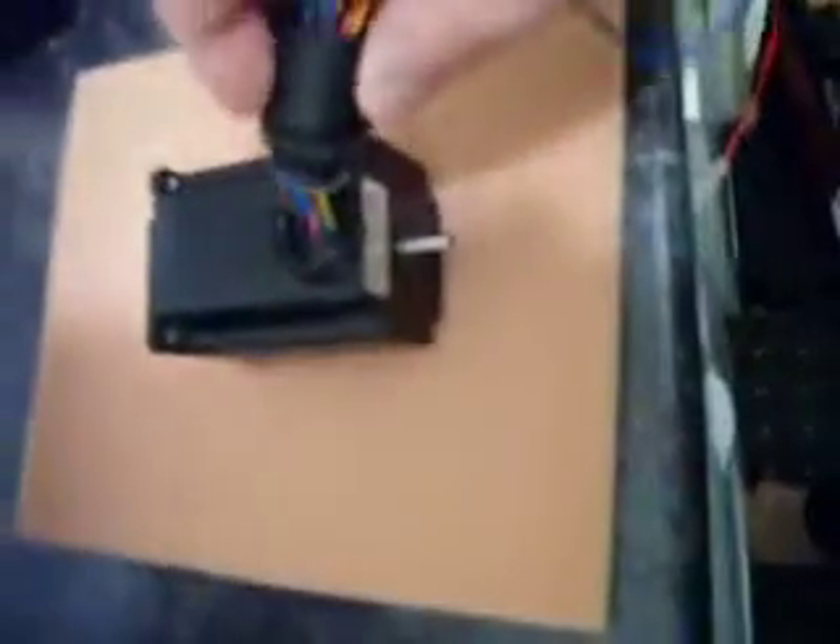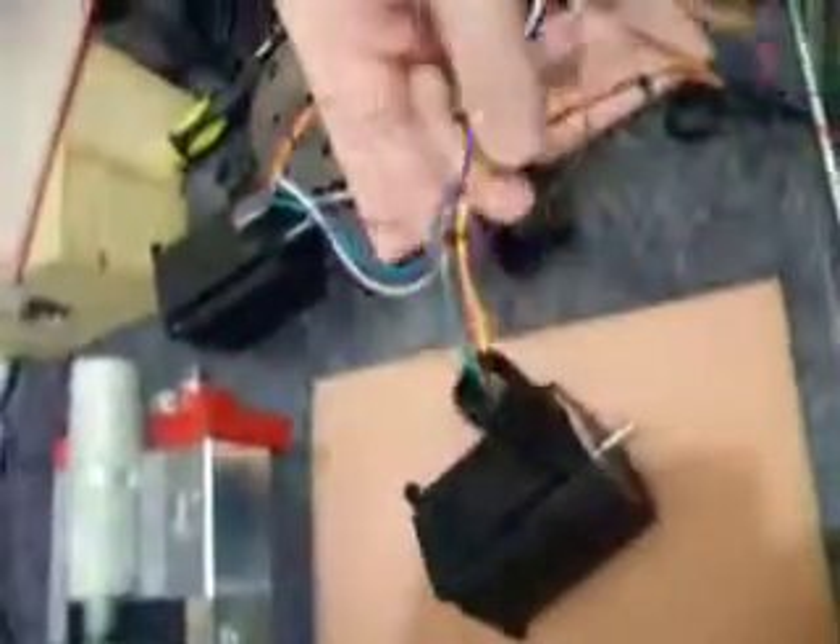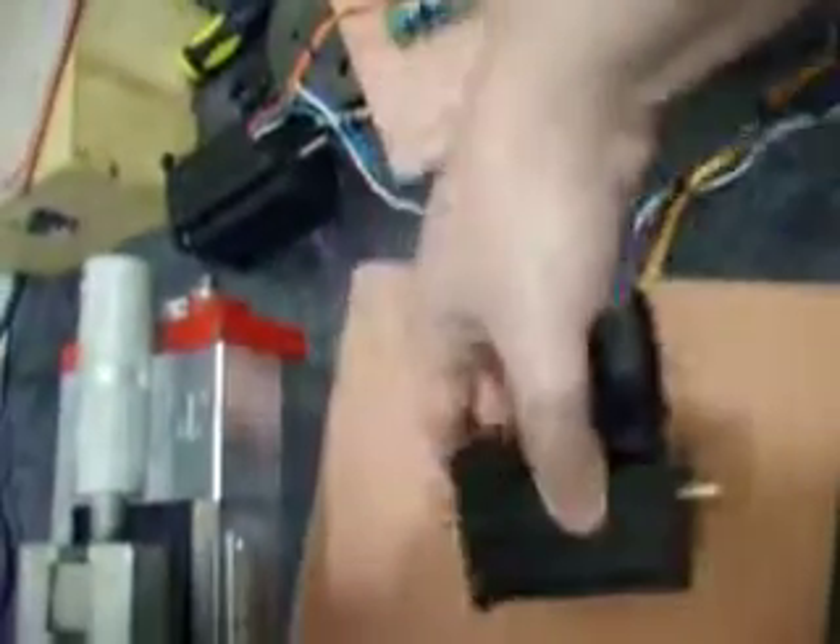So then what you do is extend that, put it inside your conduit, and cut your conduit to length. Then all you simply do is screw it on like that with your conduit on it, and all your cable will be protected inside the conduit.